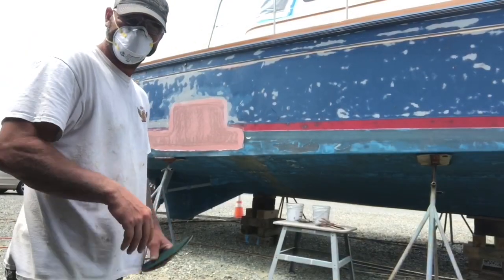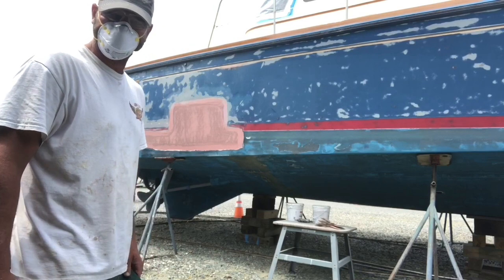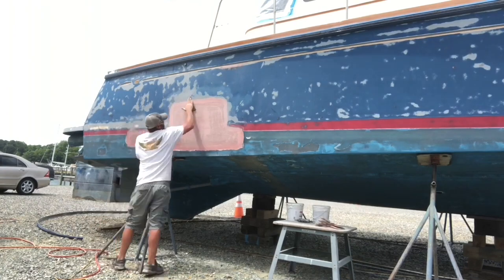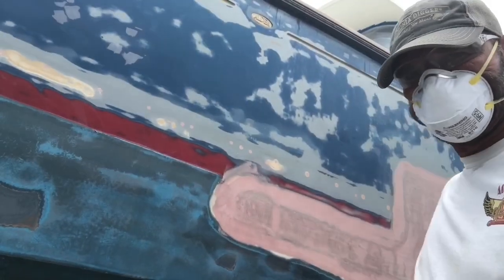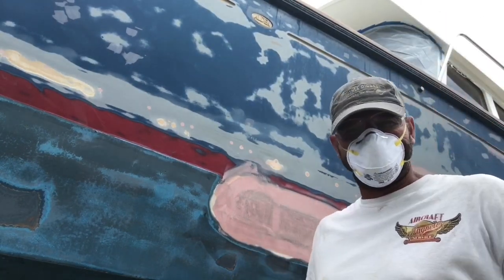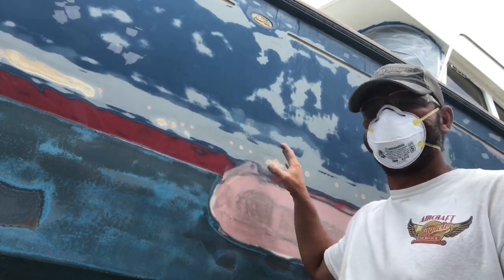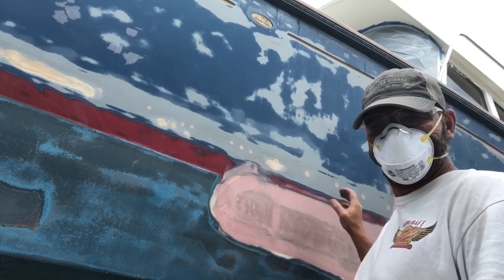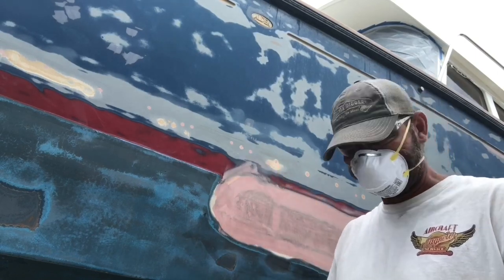Okay, fellas. Third process, third application. Same steps as yesterday. Quick and simple. So I got all this sanded and cleaned, but before doing the final coat of awlfair on that, I found some cracks in here and I figured I'd go ahead and get these busted open, seal them in epoxy, and let that tack off while I'm glazing this big spot out again, and then jump back and glaze out those.